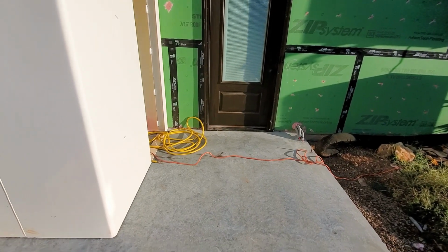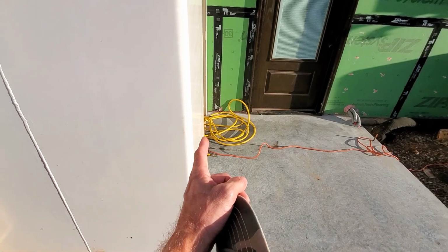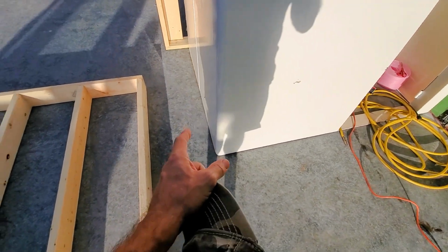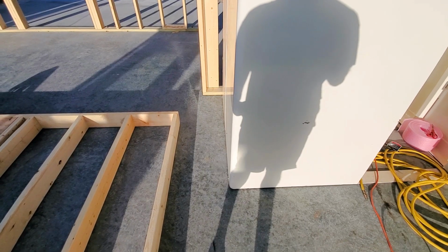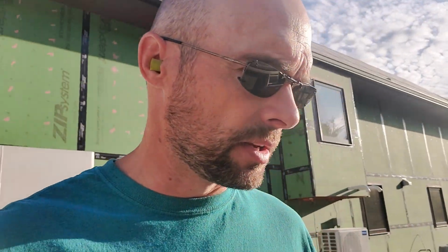But it'll be fine. So the plan is I'm going to go ahead and frame the wall against the storm shelter on this side. And I'll probably use 2x4s now. And then this, you can see I could put a 2x6 wall through there. But I'll probably do 2x4 and maybe have some recessed shelves or something like that. But that's something for me to figure out a little bit later.